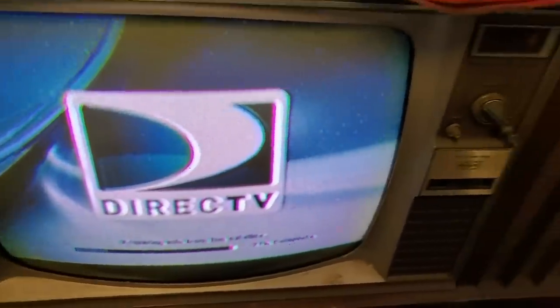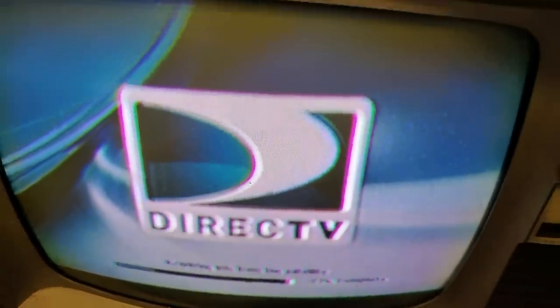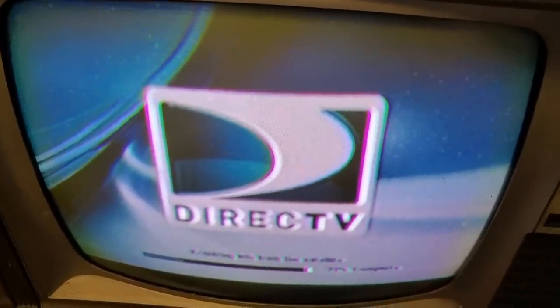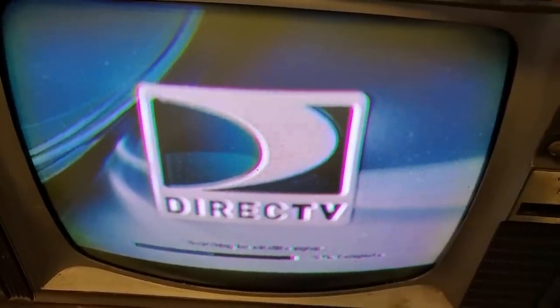Well, there it is, back in its natural habitat, and you can see the focus is way off because I focused it to the jig, and the convergence is way off, but it's all working. The problem with these things is you need a mirror or something in order to see the front of it. It's real hard to give these a reach around. So I've gotten to the point where I just use the guide on DirecTV to align the convergence. You can get your center convergence pretty good like this.